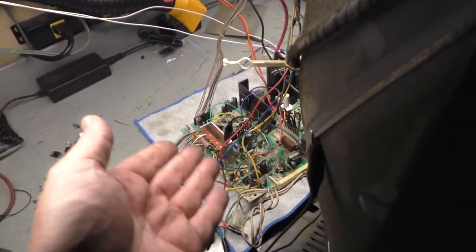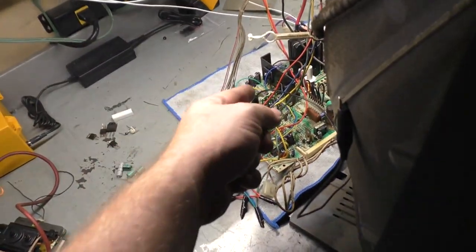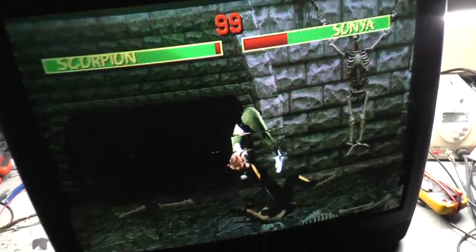Apparently you cannot run a 27 inch 5000 on a 25 inch tube. It won't work. The yoke obviously is different. So we have the 27 inch yoke with the 27 inch tube and the pincushion board adjusted properly, and we have a nice full square image. However, we still have the interference here. If we start, you can see we still have the bad interference there.